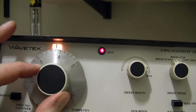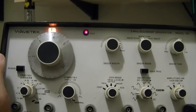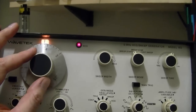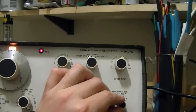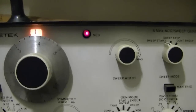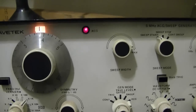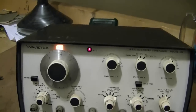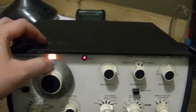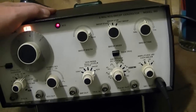But it will only go in certain multiples, like it'll do 440, 450, 460. So you can't lock into 455, which was something I was hoping I could do with this, to use it for alignments. So for the kind of work I do, not particularly useful, but it's a neat feature to have, and it's pretty darn accurate. Accurate to as good as your crystal is, so certainly more accurate than just guesstimating off the dial or looking at a scope and guesstimating the frequency, that's for sure.